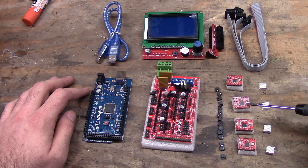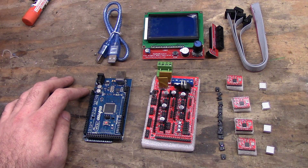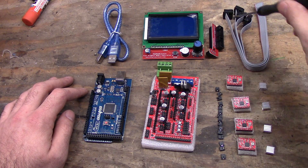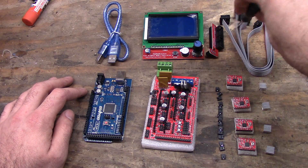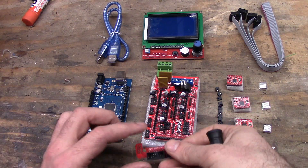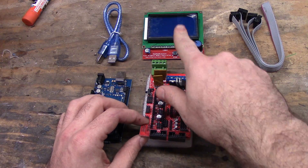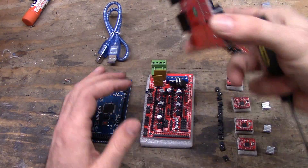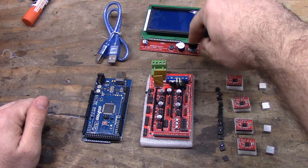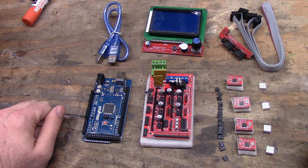They'll have an amp at 12 volts running through them, or however much you're willing to risk — I run most of mine at roughly around an amp. You have two cables for the smart controller: the adapter interface which sits on the RAMPS to allow interface to your controller, and the controller has an SD card built into it as well as a potentiometer, giving you a nice menu. So that's the parts.